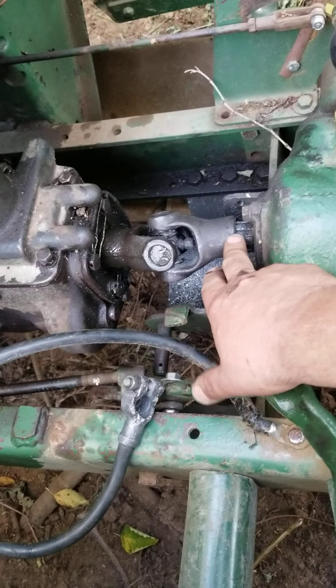You can clear blackberries no problem, but if you get into heavier stumps and stuff, forget it. You'll feel it flexing. When this started shearing, I thought the first or second gear had failed in this transmission. I took the cap off and it was fine. Then I thought maybe the pinion gear in the main gearbox sheared, but I guess it was this. So just to help anybody out who's doing this — it's hard to sort through forums and all that — this is more real world experience.